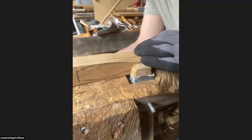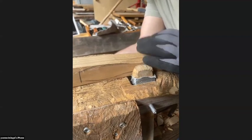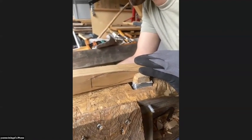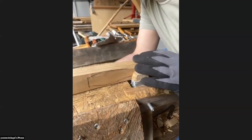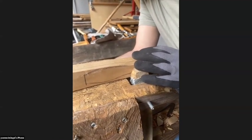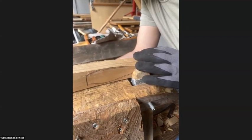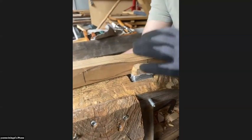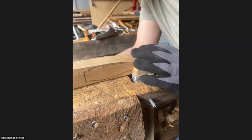But I found out that drilling the hole with a drill press won't help you make the perfect hole, because usually the wood you use is maybe just axed out, so it's not super duper straight. So if you want to drill the hole first, you could use a chopstick and stick it in the hole so that you see where the blade is pointing. Phil is showing that to you. If you drill first, you put a chopstick into that hole, and then you know where the blade is pointing. As you can see, Phil has a lathe and a drill press, so he can work with quite some equipment. This way, it's easier to drill first, make a nice hole that is really straight and parallel to everything, stick a chopstick in it, and work your handle.